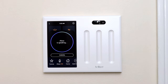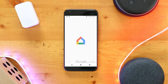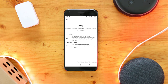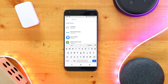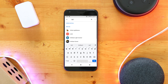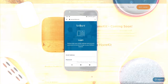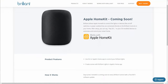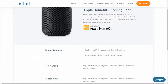While there is no built-in Google Assistant, you can set up Google Assistant to control Brilliant lights and add them into Google Routines. Adding Brilliant to Google Assistant is the same as any other integration: open the Google Home app, go to add a device, search for Brilliant, and then log into your account. Once done, you can add lights controlled by Brilliant to different rooms and control them via the Google Home app and Google Assistant just like any other light. HomeKit support is currently listed as coming soon, and according to their webpage it will be added via a software update with no new hardware required.